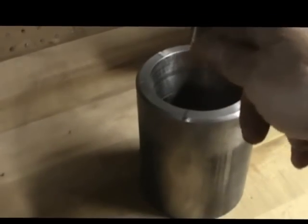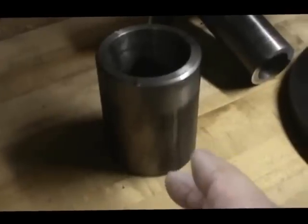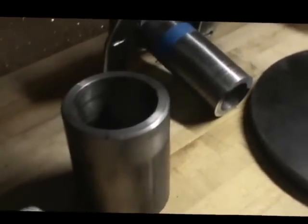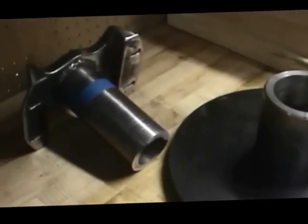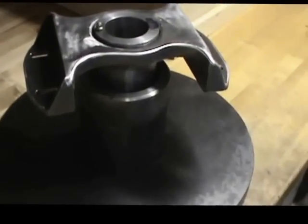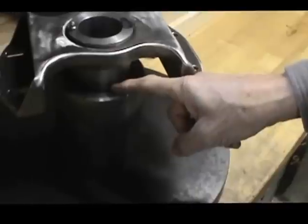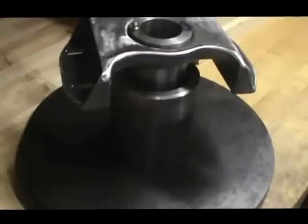We're going to do some wraps around here with some 1/2-inch square stock, 2 pieces around, and then this clutch collar will set and bolt in between those 2 pieces of 1/2-inch square stock. And what's going to happen is the clutch hub will go into this plate we have here. Byron has milled this out so this fits in there, and then we have the spider gear, which is this here. We've manufactured this. This is all ready to go. This will end up going inside that clutch hub just like that, and that little space that you see in there Byron is pointing to, this will get filled with babbitt material, and that'll be the bearing surface that this thing spins on. And we'll show you the process here as we go to this.